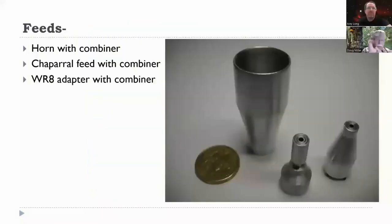Okay, next. And these are the antennas. That was the hardest part of the project because the 2 antennas, receive and transmit antennas, on the chip are not in the same position. So their beams are slightly offset from each other. So you'd have to tune back and forth to the person you were talking to on transmit and receive. Somebody in Britain engineered a horn antenna with a coupler in the bottom that coordinates the 2 beams into one beam and comes out the end.